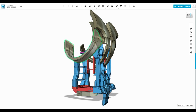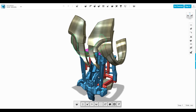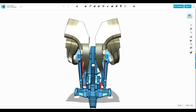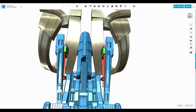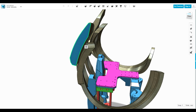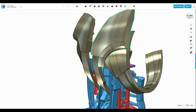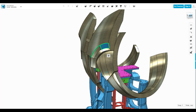Yet more scaling and fleshing out — I've actually stretched these out with the scale tool to make them slightly wider. I think this is building up to be the right sort of shape; hopefully it's the right proportions for the bottom half. You can see I've cut some scoops in there, which I did in exactly the same way by getting a flat primitive and using that to cut it. I've also cut the chest plates here by drawing on this face and cutting it to give this contour, then scaling it. If I select any of these edges, I get a little tool and I can bring that in and put a chamfer or fillet on there.